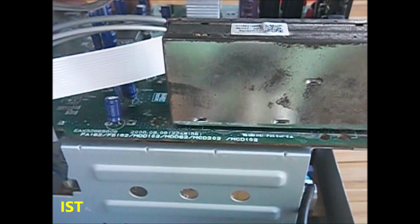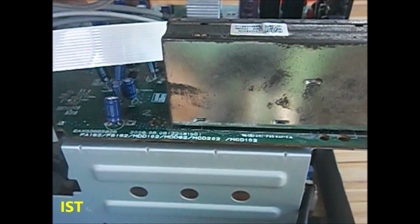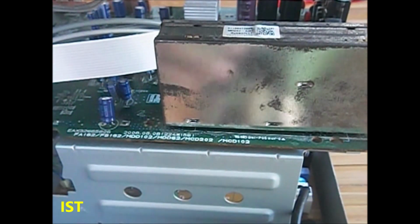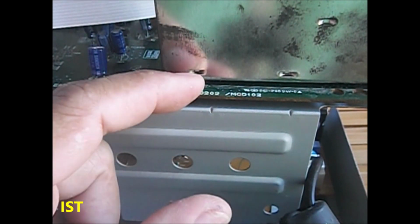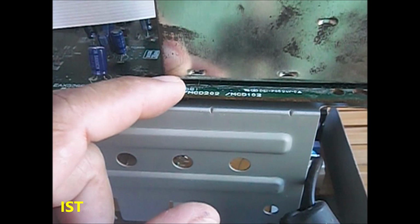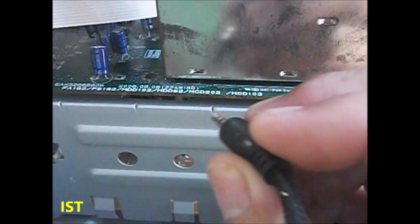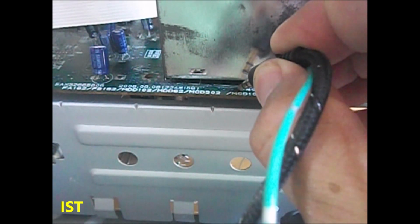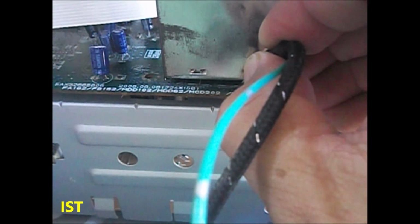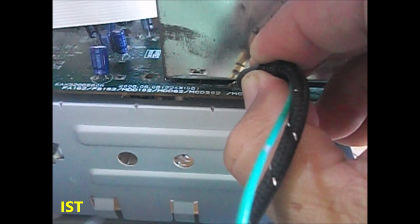Okay, so I have here a signal tracer. So in this method, I am going to show you that the signal is there but not reaching the speaker terminals. Because if I am always explaining, or if I am just telling you by words, maybe you won't believe me that the signal is there. So I am probing to you, so I will use my signal tracer here. I'll turn it on. Okay, so this is my signal tracer. So we are going to trace this connection here. This is the audio signal. Okay, so there you go, the signal is there. So this is the other channel and it works also.